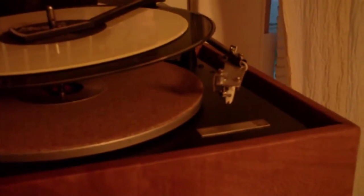The tonearm was a little bent, but it still played a bit. However, it used custom cartridges, and I wanted to use a more modern-style cartridge, so I made a custom tonearm to accept half-inch cartridge mounts. If we get the whole unit in there, you can see I made a custom counterbalance back there.